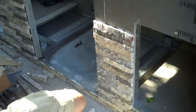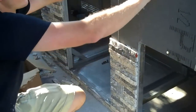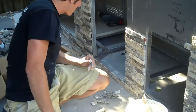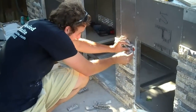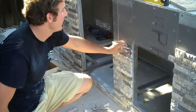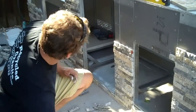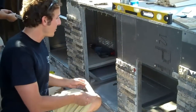Some of these are pretty much flush, but you can drop a level on top here. And that looks pretty good, but if we need to, we can take a couple of these little shims and just kind of pop it under the sides, lift it a little bit. And then just move on to the next row. Try and stagger them so the seams are not lining up together.